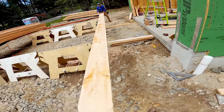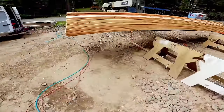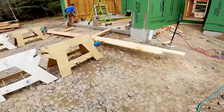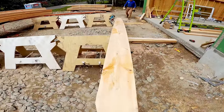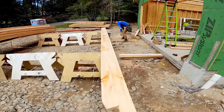We had sections that landed on plates. So that's the ones we're cutting here. Then we had sections that hangered into that 5.5 by 15 garage glulam. And then we had a section that landed into hangers on 1¾ by 14. So that's why we did these in stages.